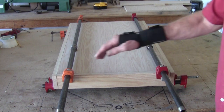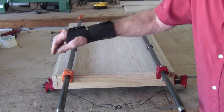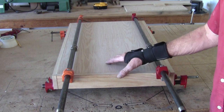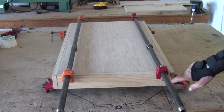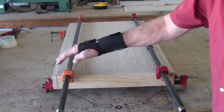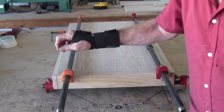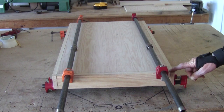Okay, I got these two pieces here, I cut them down. Now if you noticed, I don't know if you can see it on camera, but they're overhanging just a little bit, both of them, on all four corners. Now I clamped this to squeeze this together on the top. Then I clamped the bottom to squeeze these joints together. We want it all tight, so go around and check all four corners to make sure everything's really tight after you do this, and make sure these are flat. Tap them, tighten this down medium, then tap until you get all four corners flat.